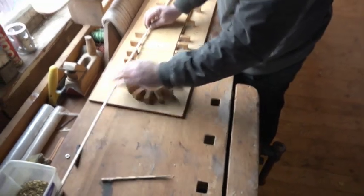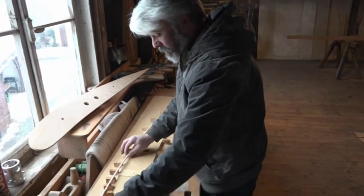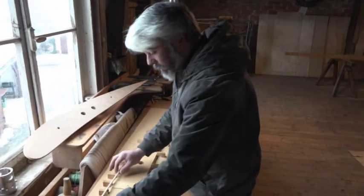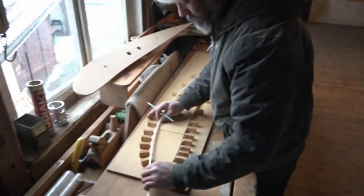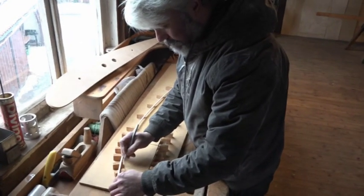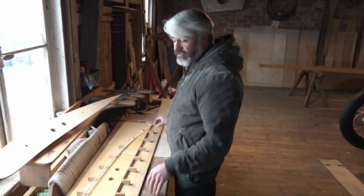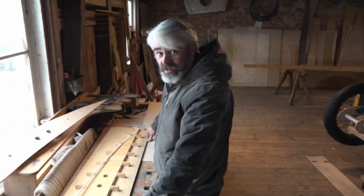We have to pre-bend and pre-shape the front portion to make the stringer follow the rib contour. Otherwise, because of its own tension, it would work against the shape of the rib during nailing, and we don't want that. To bend wood, we need heat. Many think that you need steam or have to cook the wood, which is not the case. To bend wood, you need heat.